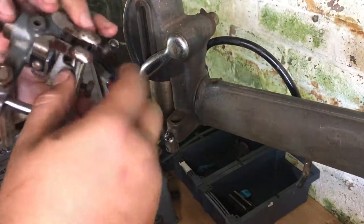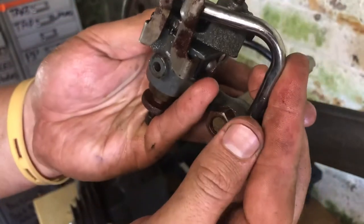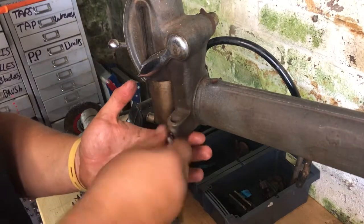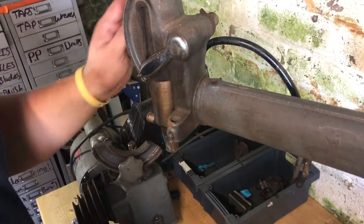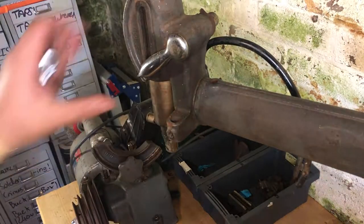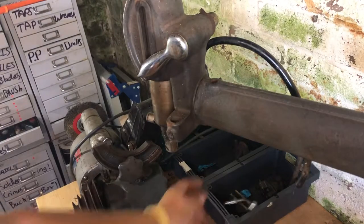I'm going to make a comparison — it's an unfair one — but I've actually got a Delta scroll saw as well. I'll compare what you get from the 20th versus 21st century and you'll be amazed. What we're looking at here is the blade guide housing assembly, very similar to a bandsaw. Looking through the original manual — I'll put a link in the description — you can actually run files through this and use it as a die filer, which I'm going to investigate. I'll have to make my own blades, but I'll get into that in the next video.